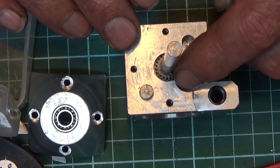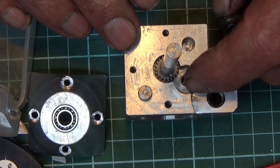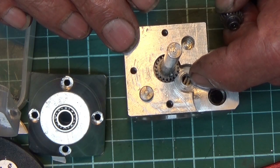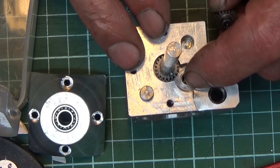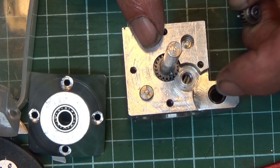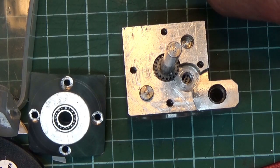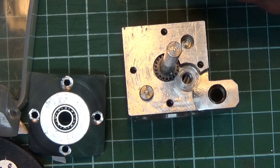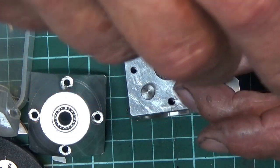These are 12mm countersinks for the gears. I put a 12mm end mill in it, and I powered it straight through the broken tap. It pulled it all out, and then I put a 12mm aluminium plug in it, a very tight fitting one with a bit of Loctite, and I managed to salvage the block. That's not the first salvage job I've done.